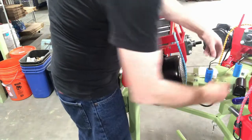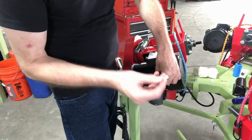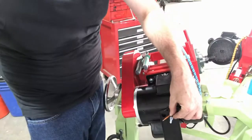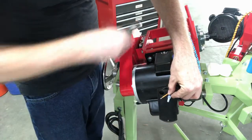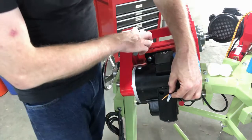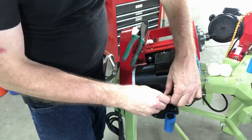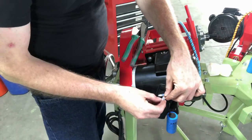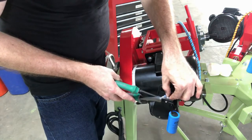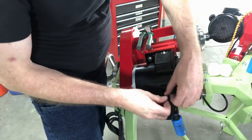I've got my two wires now. I'm going to take my new capacitor and put two wires together — I'm not twisting them per se, because I'm going to use these little butt connectors. I'm going to put that in together. That connector just slips on those two wires. Then I'm going to use my crimper, put it right here, go crimp, and I want to make sure that's good and crimped. I'm going to pull on it — I really want to pull on it and make sure that's good. I'll do the same thing to the other wire, put these together, grab my butt connector, slip that on, get my crimper, crimp it really good, and check it. It feels good.